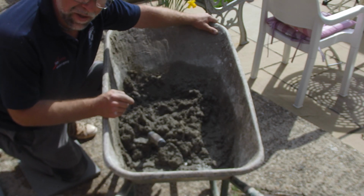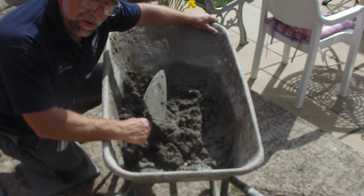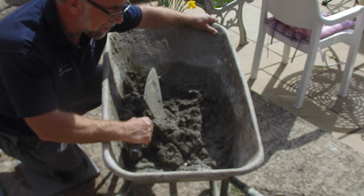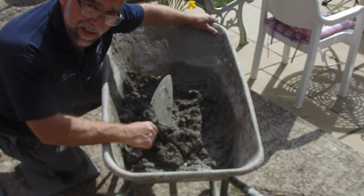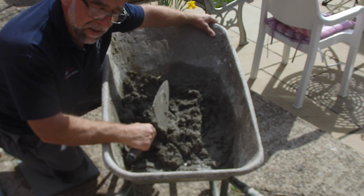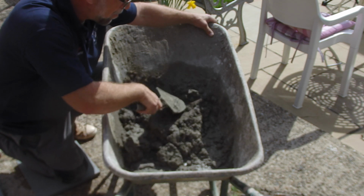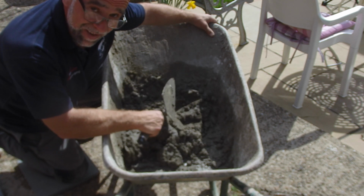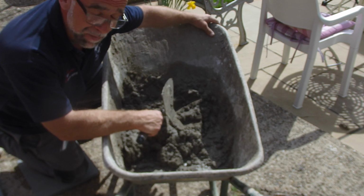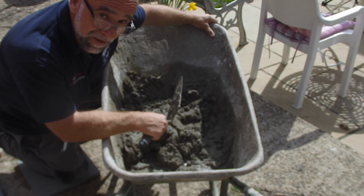The texture we're using today is not too wet. It's almost like a semi-dry mix, which I find is much better to use. If you were to use a bricklaying cement consistency, you find that the tiles move around a lot. With a semi-dry mix, when you've laid the tile, they should stick pretty fast and won't tend to move as much. Right, let's stick them down and see what they turn out like.